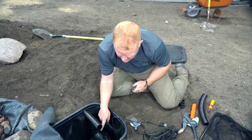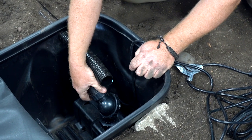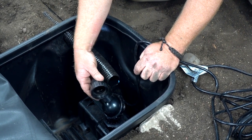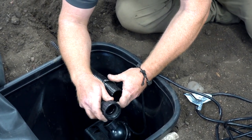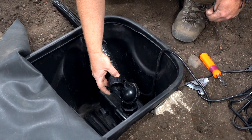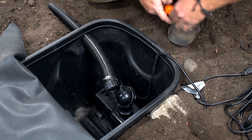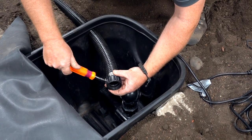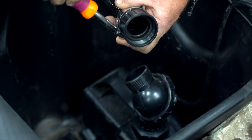We've got a hose clamp and then that fitting. What I don't want to do is try to shove this onto the pump. The easier way is to take this off — you can see this little union fitting right here. I'm going to take this off, put my hose clamp on first, and then take this and just slide it on. Now that I've got that barbed fitting on there, I want to bring my clamp right up to the edge and tighten it up so you can't tighten it anymore.